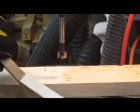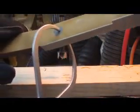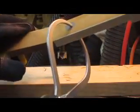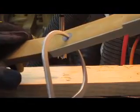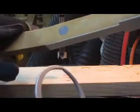Now, this particular key has a lead showing on one side, and the other side is blind. So we have to use this gauge by setting it like so, and then zeroing it out. You won't be able to see me do this on camera, but the idea is you set it like so and then zero it out, and then as you reduce the lead, this dimension will keep on reducing and you'll be able to read it in the display how much lead you're actually removing.